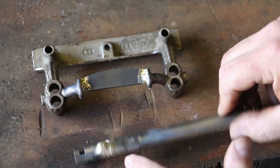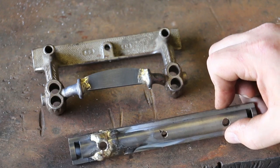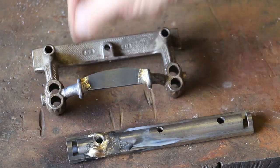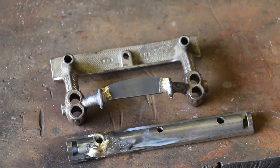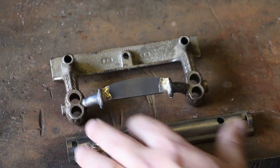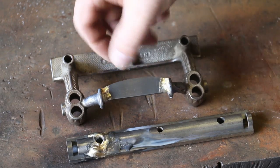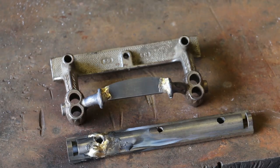As we were brazing the bottom of this, we had some kind of run up and puddle up underneath it. It was wanting to kind of suck it down. So you've got a little bit of material to remove there, but between some grinding and a couple of files, I don't think it'll be too much trouble to get this cleaned off on either side. And I'm pretty happy with the results. I think that should hold up for you fine, and with the V-ing out that we did, you should be able to, at least on this piece, take that down almost all the way back down to the bare metal and still have plenty of braze in there to hold it in place. And on this one, I might want to leave a little bit of radius in these corners just for some strength, but I think you'll be fine there as well.